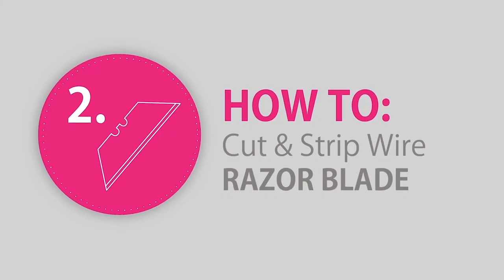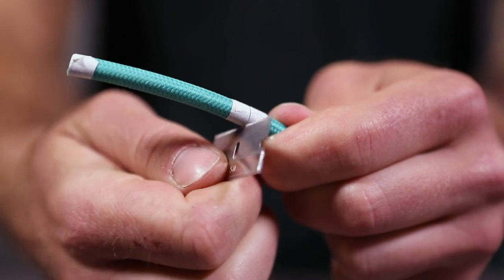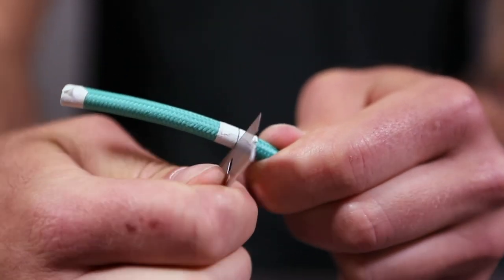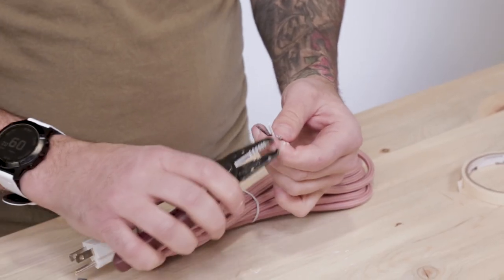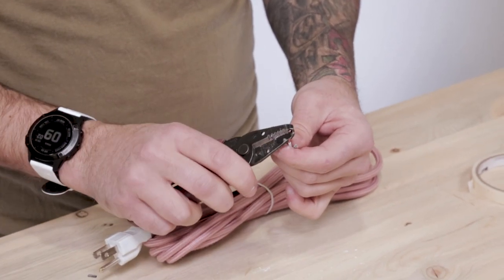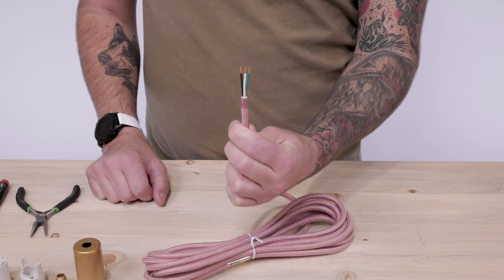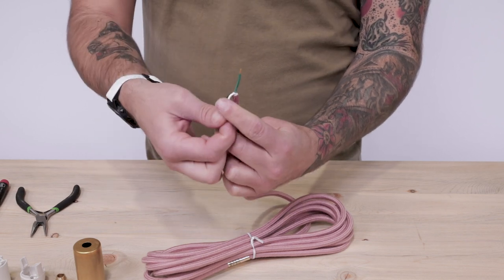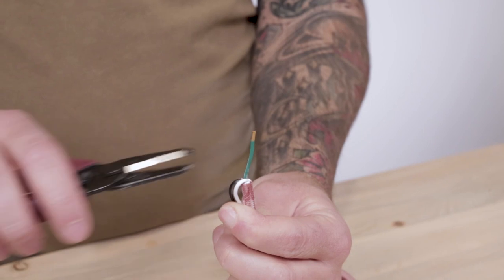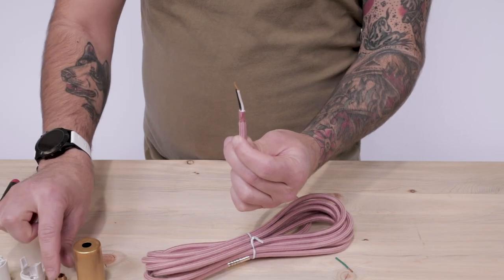If you don't have a ColorCord 3000, check out our video at this link in the corner on how to cut and strip cloth covered wire using a standard razor blade. Then strip about 3 sixteenths of an inch off of the conductor wires, exposing the stranded copper wire underneath. Now for that extra step: our E12 sockets are not grounded and therefore there is nowhere to connect the green ground wire to the socket. So all you have to do is snip away the green ground wire and proceed to the same steps as the two conductor wire.